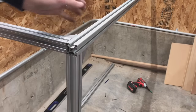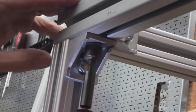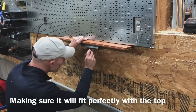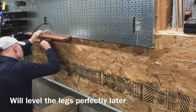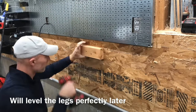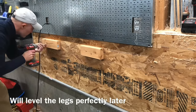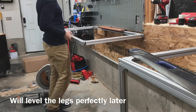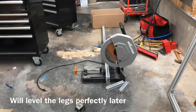It's not super sturdy, so if you're a blacksmith working on an anvil on top of this, I'd probably get something more substantial. I design everything in my head rather than on paper. What I came up with was a half-inch MDF top on the extrusion, and then on top of that a quarter-inch sacrificial replaceable top. I needed that three-quarter-inch spacing between the extrusion and the pegboard, which is why I used that three-quarter-inch plank of hardwood.